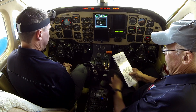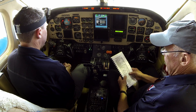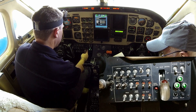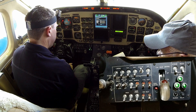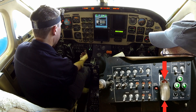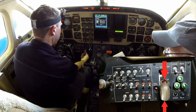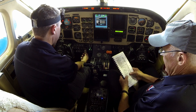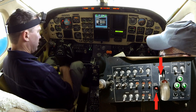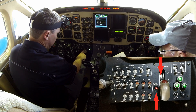We're continuing back across the panel to do some things we couldn't do without the battery switch on. Landing gear handle lights — press to test. Notice there are lights both top and bottom. It's notorious that the bottom bulb gets loose, falls down the carpet, and gets lost. Make sure you're occasionally checking that it's tightly in. Landing gear handle safety latch — visually confirming it is locking over the handle.